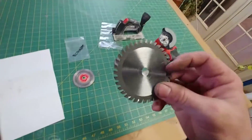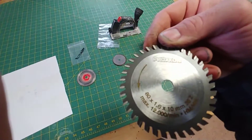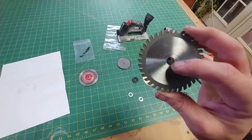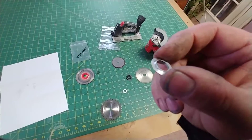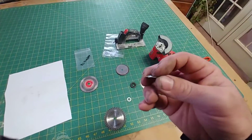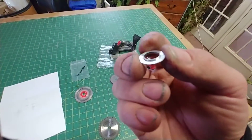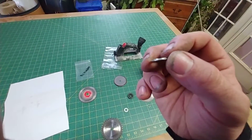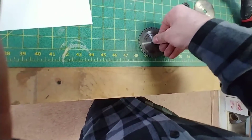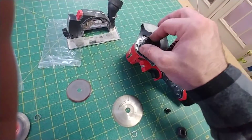I was able to get this Proxon 2X blade, listed on Home Depot. It's three-and-three-eighths inches in diameter with a 10-millimeter arbor hole, so I had to go back and make another little adapter — just turned out of aluminum on the lathe. I know not everybody has that; I'll show you the drawing at the end, and you can take a snapshot and ask a machine shop. It probably wouldn't cost much, maybe 20 bucks. There's a three-eighths hole, then a 10-millimeter diameter shoulder that's 40 thousandths of an inch thick — matching the blade thickness — and then a five-eighths back surface. Press it into the blade and it sticks in there, and then you've got your backer washer.